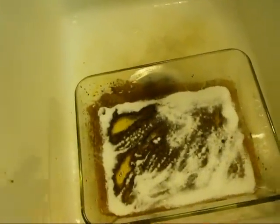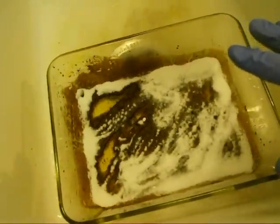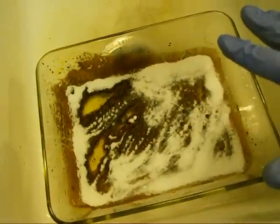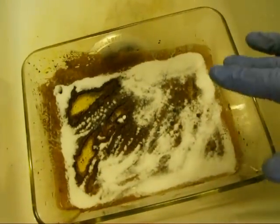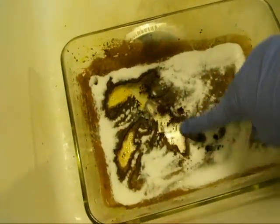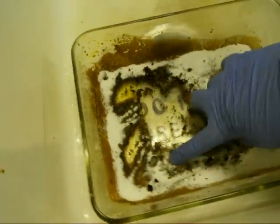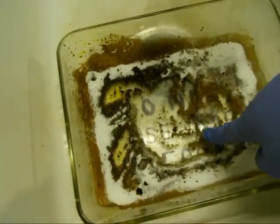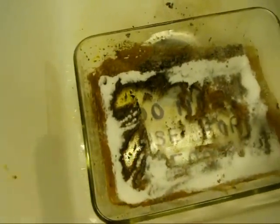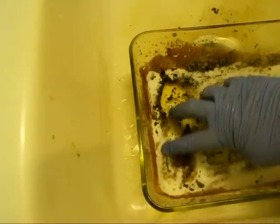When I'm ready to wash out my glass container, I'm going to pour all the acid back out of it as much as I can, and then I'm going to pour baking soda to neutralize it. You can use the baking soda to neutralize it if you get it on your skin or anywhere else. Neutralize it before you rinse out the pan. I've written on the bottom of the pan in permanent marker: 'Do not use for food,' just in case anybody picks it up who doesn't know.